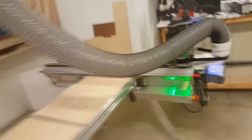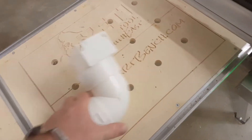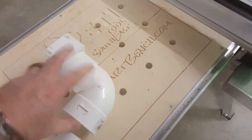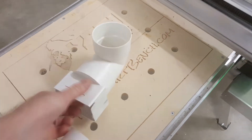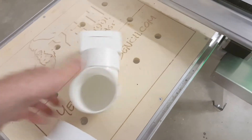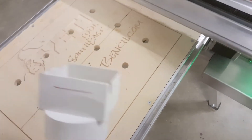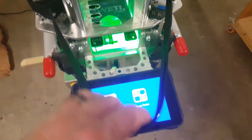From here it just drops down. It's got a slinky hose — 4-inch — goes to a 4-to-3 connection, and then standard PVC fittings from there: 90-degree elbow, 3-inch to 3-inch, and a 4-by-3 gutter connection that I've modified. I'll show you the modifications in a different video. It'll all be spliced in on this.